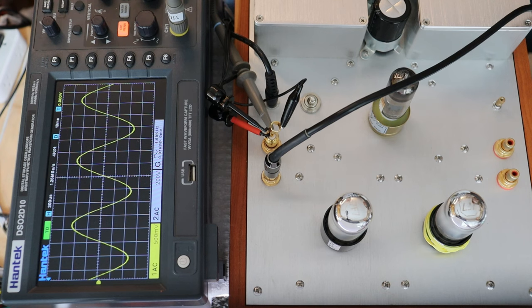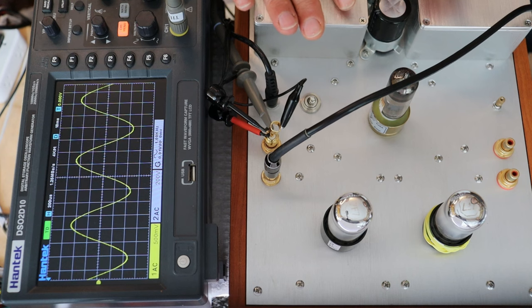So when microphonics get excessive, you'll hear a ring that echoes. It'll just keep on echoing. So it's not just a ring in which you tap the tube and you get a little bell off of it. It'll just keep on going. So you'll get a ring, a ring, a ring. And that's when microphonics are a problem. Or if you just literally touch the amp and the tube rings, then that's a problem. Or even walk near it. Yeah, that's a problem.